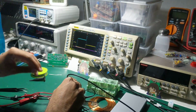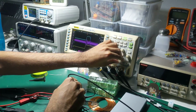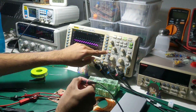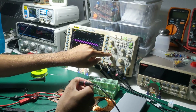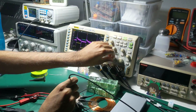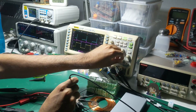Is it zero? That's because I have it set at 5 volts per division. So let me move this up. Let me turn on bandwidth limiting and probably 1x mode. That might help. You need averaging. Forget averaging, so I set it to 1x. No, trust me, for the current measurement I needed averaging as well. Let's see what 1x and bandwidth limiting does. I bet it won't do much. Very telling. And because Utsuho recommended it, I'll also do averaging. Acquire normal average. That helped.